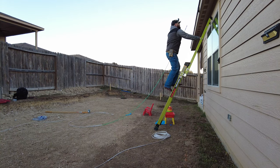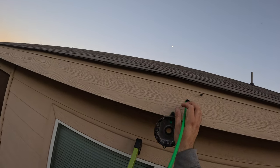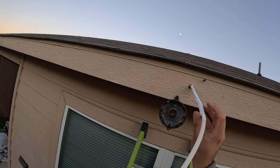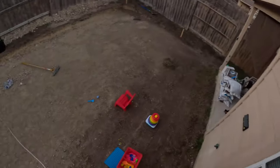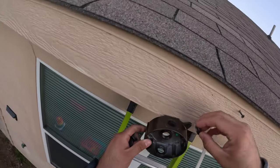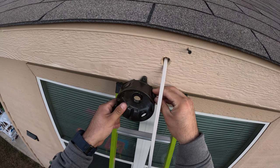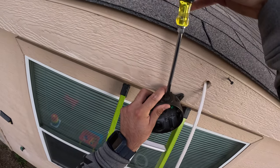As I'm pushing in, I want to get as far into the attic as possible so that when I get into the attic, I can see that Ferret and grab it and then pull all the wire to where I need it. While the box is still loose, I use this time to install the half-inch threaded knockouts provided with the box. Remember, these knockouts are needed to make sure that this outlet box is weatherproof.